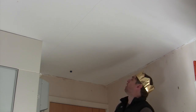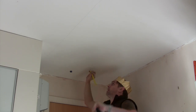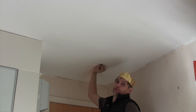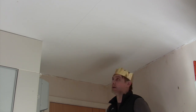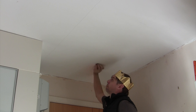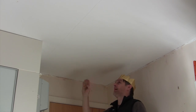So I should be able to install a downlight into this space here between these two joists, reasonably sure that there are no obstructions that I'm going to hit. Obviously there may be some other things up there — water pipes, cables, a wooden noggin going across the other way — I can't be completely certain without seeing it from the other side, but I can be reasonably sure that if I put a hole here it's not going to hit those joists going down the room. There you go — the joist magnet is a bit jolly handy for downlight installations.